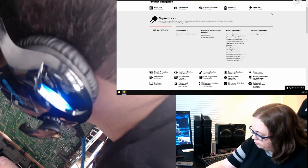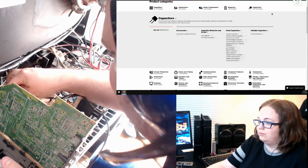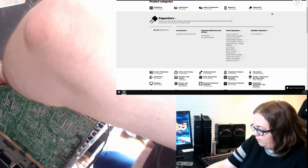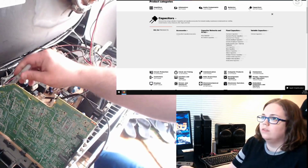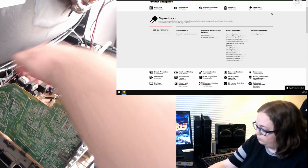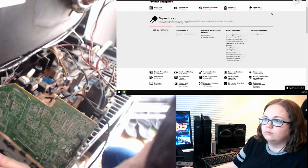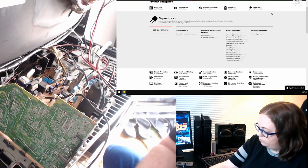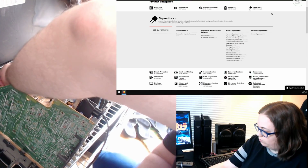C810 is a giant pain in the ass to get to. 50 volt, 0.47 UF. It's an odd one. C811 is that's another strange one. These two look completely different than the rest of the caps. They're a different brand. Their writing is top to bottom instead of down the side.